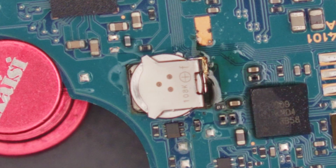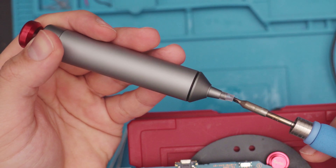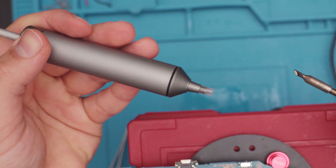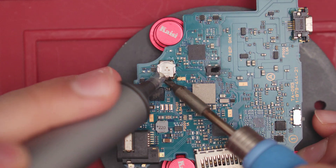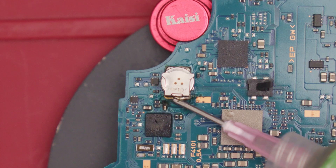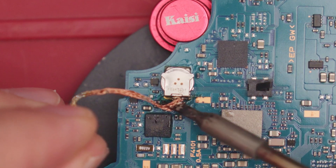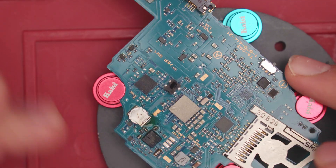It's slightly lifted and I could try my solder plunger. Basically, when I load it up and press the button, any melted solder should get sucked out. Then when I click it back, it's going to spit out whatever solder was there. What I could do here is add some more flux, get my solder wick, and just wick up everything I could. I think that should be enough for this side. We'll come back to it — let's flip it around. Be mindful of the sensor.